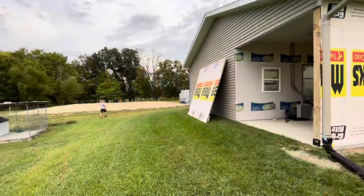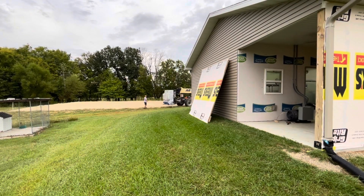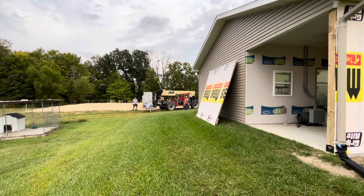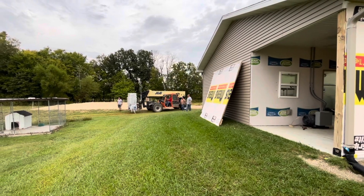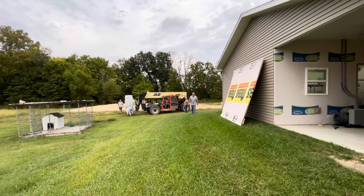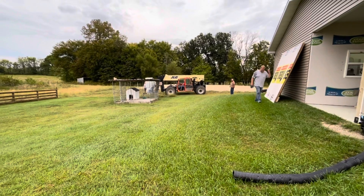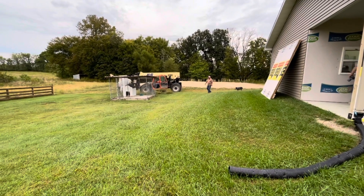Unfortunately you can't just use your standard shop air compressor. You need a dedicated laser air compressor, and you need somewhere around 50 CFM and 230 to 240 PSI of air pressure — around 1.6 MPa or 16 bar. Your standard air compressors just don't produce the volume and air pressure combination needed to be able to cut with air. You also need multiple stages of desiccant and air drying.